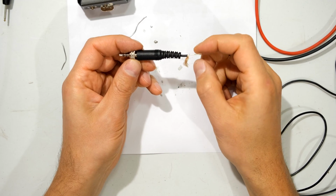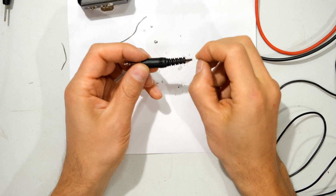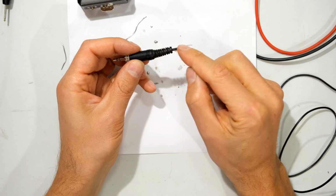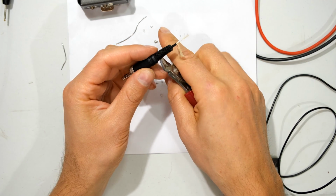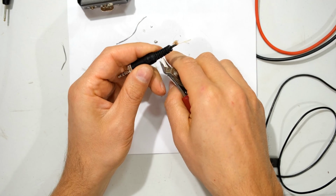What is happening is the signal from there to there is intermittent, and even when I pulled the signal wires, the copper, they just came out. So somewhere in here it is actually torn. So unfortunately I'm going to have to actually cut this open. So what I'm going to do now is I'm going to cut it. I'm assuming it's broken just on the edge here.